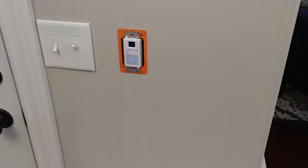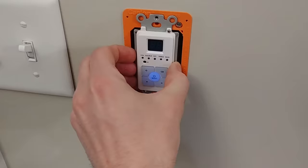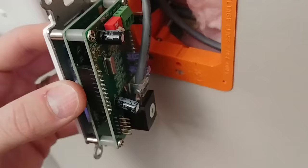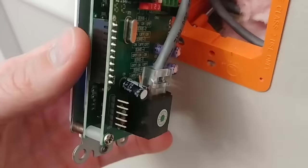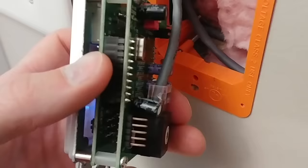This is the keypad when I've removed the plate and unscrewed the screws. This is just a standard low voltage bracket for existing construction — I had to do all this work after we moved in. The Monoprice amplifier's six zone keypads are different from the Dayton Audio ones because of the back piece. This is a pre-terminated ethernet jack that plugs into this keypad. The Dayton Audio ones use a keystone jack where you don't have an ethernet end — you strip back each individual ethernet wire and put it into the keystone jack and screw it down.